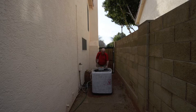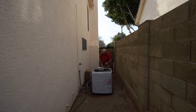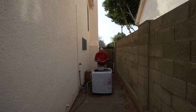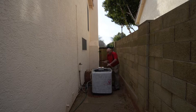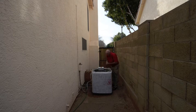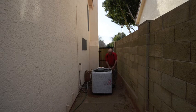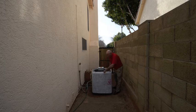Now as you can see, I've got the outlet tube here. We've got 1 to this side, 1 to that side, and 1 to this side. This is where you take the 3 pieces of 17-inch tube. All these fittings are what we refer to as push fit. Insert 1, 2, and 3, so that we've got nice coverage to each side. Next thing you do, again scissors come into play, is just cut the tube level with the edge of your condenser.